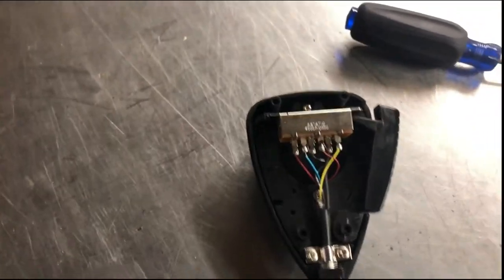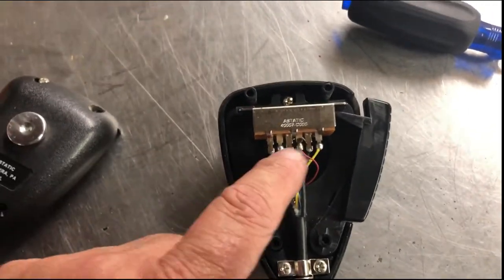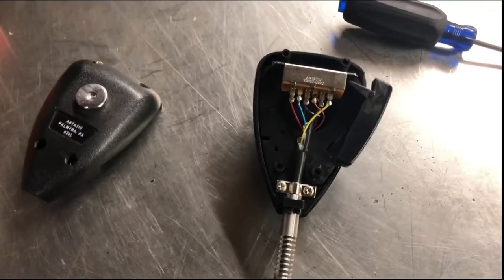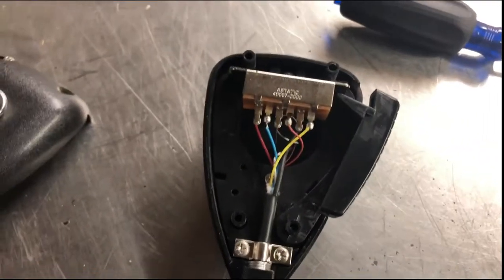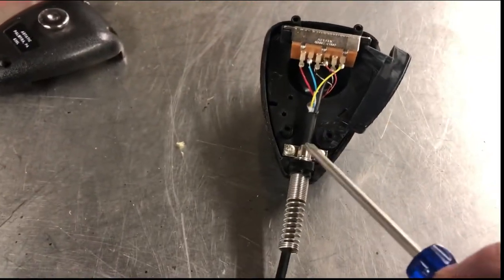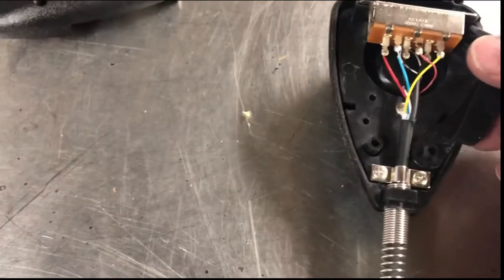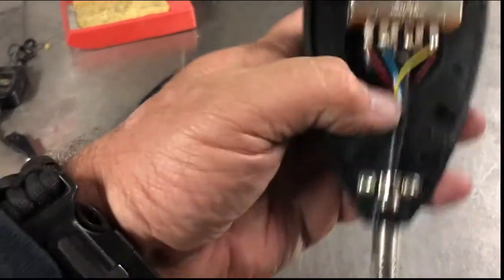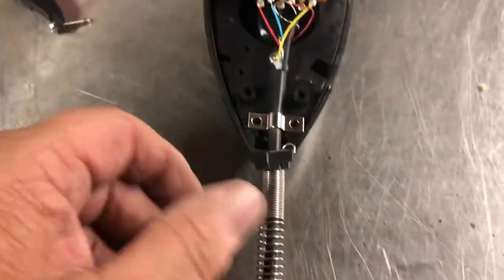I have the other one there; it's holding on that CB cord. Here's the switch. Basically we're gonna solder these wires, then cut this cable down — I'm gonna cut off quite a bit of it, shorten it up, then re-solder it. Shouldn't be too difficult. This is a mic switch, a momentary switch to keep the mic cut. We're gonna go ahead and remove this.